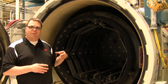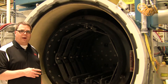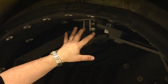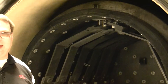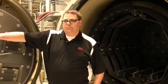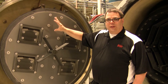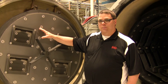When we look at this furnace — a sample of a furnace that's well maintained, very well kept up, with very good vacuum integrity and leak rate — let's take a look at the power feed-through area. We can see the cleanliness is exceptional in the power feed-through area and the molybdenum and assorted hardware. Looking at the hot zone, we can see the molybdenum, the hangers, the pins, the graphite — there's no blue, no gold, no yellow, no colorization. The cleanliness is indicative of a furnace that's well kept, has an exceptional leak rate, and a gas delivery system that is totally leak free.